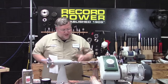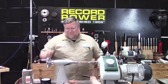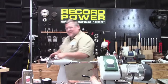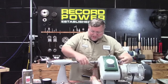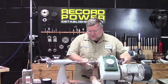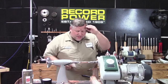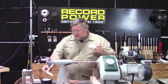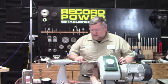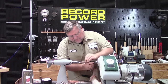I'm going to be doing a Mylands Friction Finish Polish, using Yorkshire Grit in between the sanding sealer and the Mylands Friction Finish. The reason I do that is it gives it that extra little shine. If you haven't checked out the video on the Mylands Yorkshire combo, feel free to go check that out — it will walk you through step by step. We'll cover it a little bit here. First step is to sand up to 240, or in our case we did 400, then apply sanding sealer. I just noticed a couple little lines from my turning that I want to get out — do that before you start. That's why it's good to inspect.